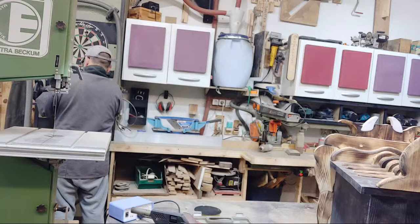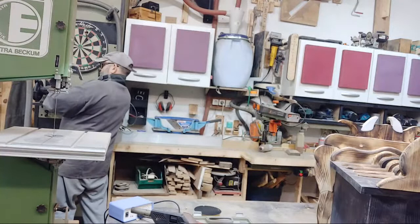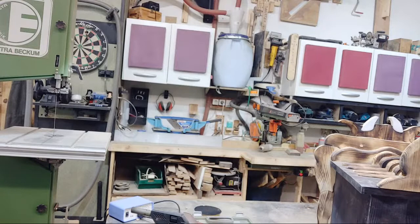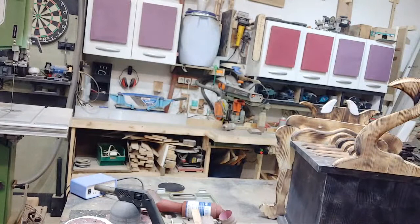Using the side of the wheel because it's flat. When you sharpen a drill, you kind of twist it onto the wheel. You're spinning it almost. You're not trying to create a flat grind. What happens is the back will become proud of the front and then it won't cut. Hopefully that is better.